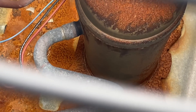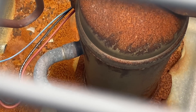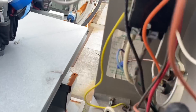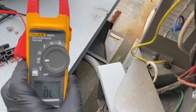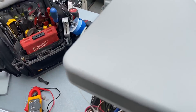We do have a condenser base that's starting to rust out — we're literally ocean front, so that's kind of expected. Taking a closer look at the condenser fan motor, it's been replaced once before — probably when they jerry-rigged that dual capacitor. I checked for shorts to ground between L1 and ground and L2 and ground with my multimeter set to continuity, and I did not have any shorts to ground.